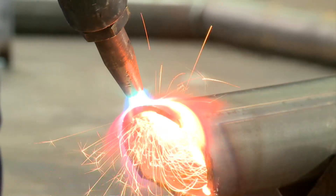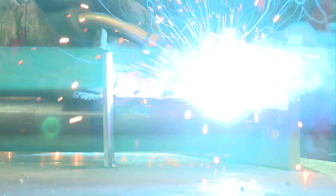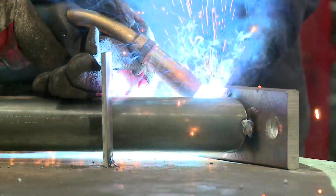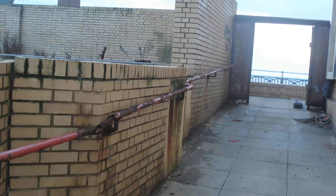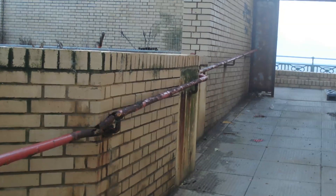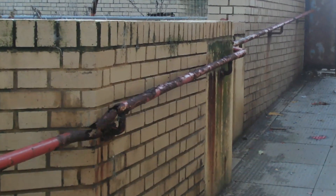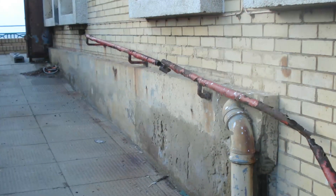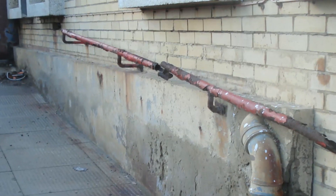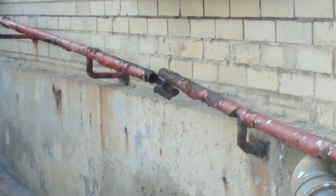There are many health and safety implications associated with on-site welding. Cutting holes breaches the metal's anti-corrosion coatings, which are then further compromised by welding. Corrosion properties can be restored by painting the fabricated rails, but this has to be meticulously maintained to ensure lasting protection. As many components of guard railing are hollow, internal corrosion where coatings have been breached is also a major problem, and often not evident until it's too late.